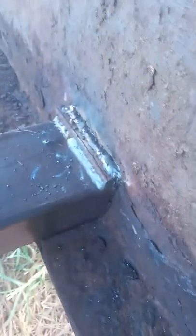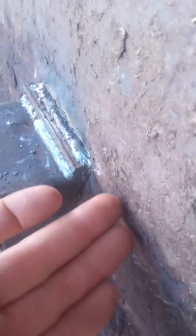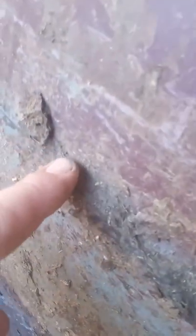When you're welding into this stuff, man, it's hard. You have to just pound and grind and flake away just to find some decent steel. A little tip for you: if you are welding to something like this and you have gaps or need to raise up — I couldn't weld to the rotten stuff, I had to weld to the plate that's in decent shape. If you need to fill a gap, get some rebar, chop it off, set it right on there, weld top and bottom. Works super good.